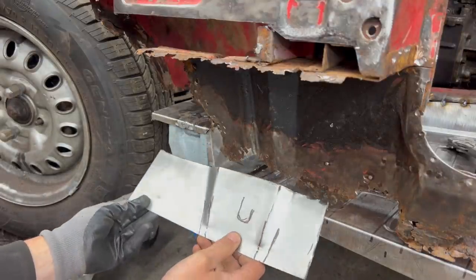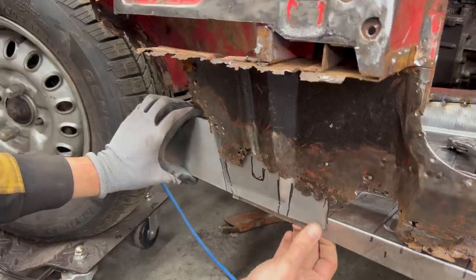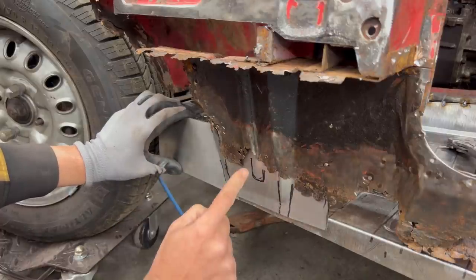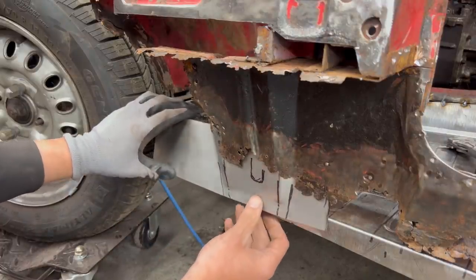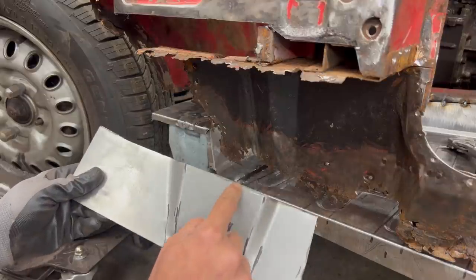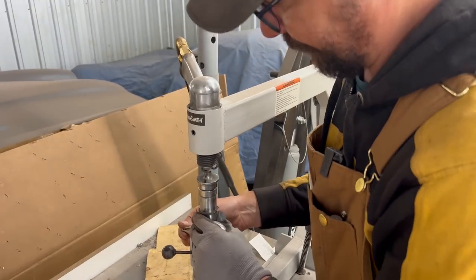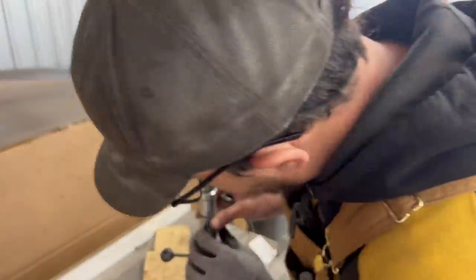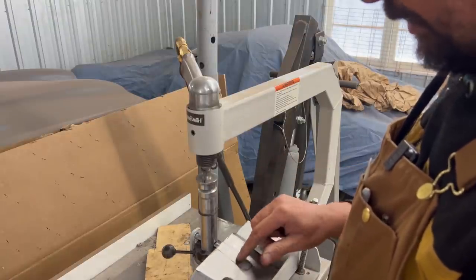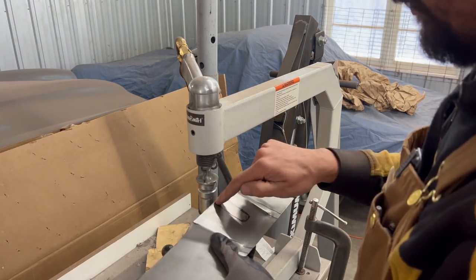I've got markers so I can do it on the other side. That's more or less there. Actually I can do this right? This flange is way too long, we're gonna shorten this. That's how much it sticks down actually. So now we just need to make this shape here, but we need to stretch a lot of metal here. Let's pre-stretch it on the planishing hammer. I'm gonna put this die with the highest crown. We won't be able to go that deep with the die but at least we're gonna be able to pre-stretch it here a lot and then with the hammer we're gonna finish it. So we're gonna stay only inside this area.